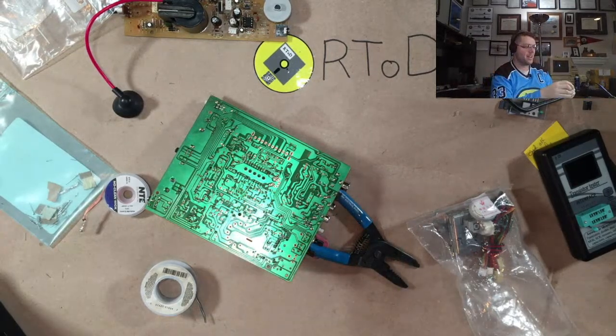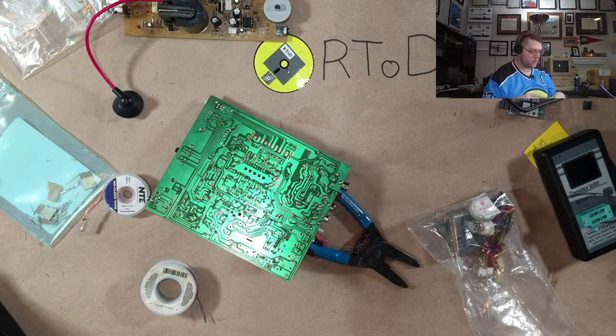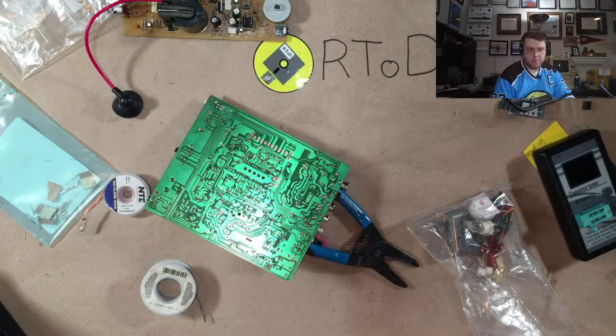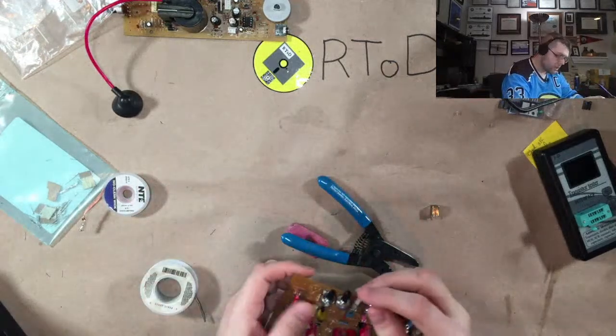not there. And I see this a lot with the resistors as well, because the resistors, and we're going to show this in part two of the video, I recorded it and I got some really good video where I will get four resistors of the same value, right? Measure them, they'll be all over the place. Wait, one of them is way out of spec. Some resistors don't have all the color bands on them, so I don't know. You have to test them. You don't know what their rating really is. So it's interesting with this kit. Not really sure what you're going to get sometimes.